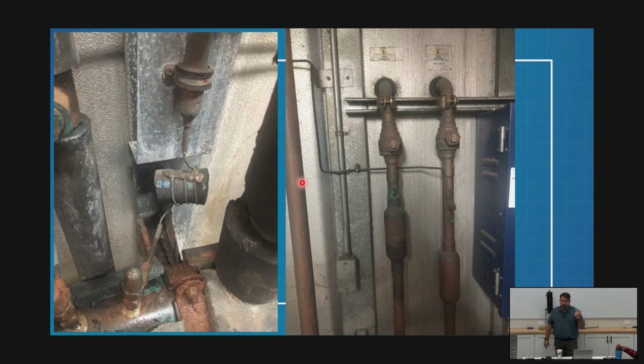All right, so here's what it looks like. That ain't pretty at all, right? It looks kind of rigged. Okay, it's a cap tube. This is just a capillary tube, and we've wrapped it around a piece of insulation so it won't rub on itself and create a hole. That's the only reason that black insulation is there and it's coiled up. But if you look at it right here, you can see it is literally a cap tube. We're coming out of a quarter inch piece of pipe, and we just go to a tiny tube, and then we're dumping right into the suction header. Yep. That's all it is.